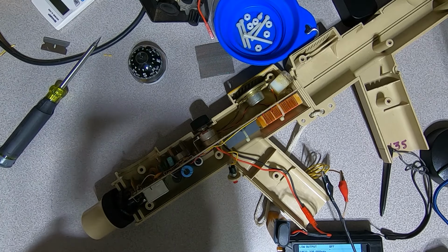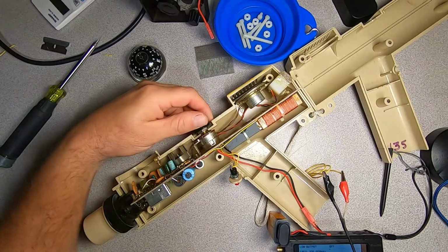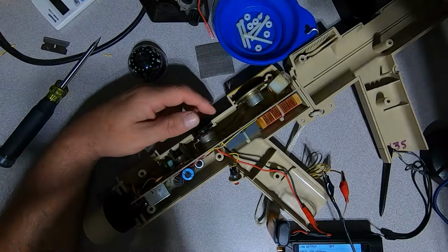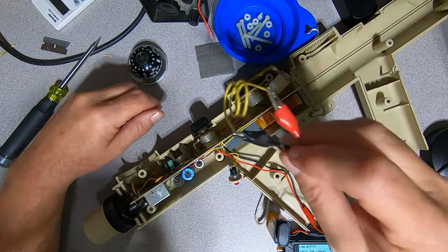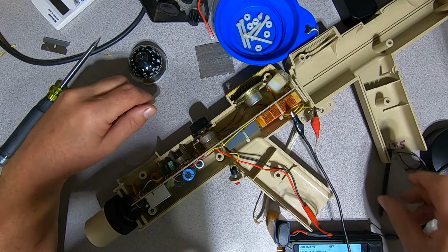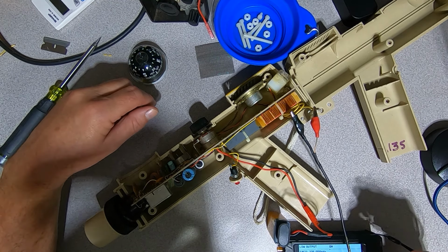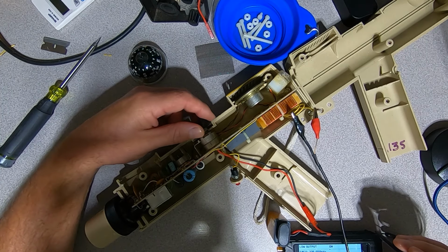I've had to turn the LED light off because with the LED light on, you can hear the LED light interference there. And then turning that off. So we've got a little loop hooked to our signal generator. Stick that there by the antenna. And let's go ahead and give ourselves a carrier. And that's it, minus 65.6 decibel milliwatts.